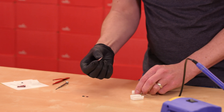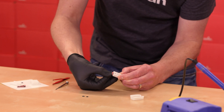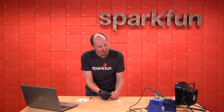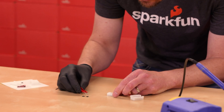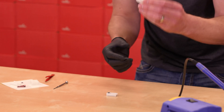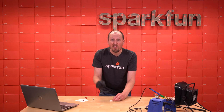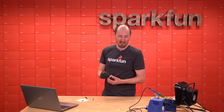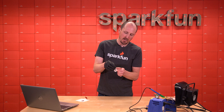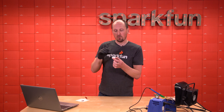For reassembly, take the PCB and slide it into the slot on the inner shell, line it up and it gets a little tension and then locks in with a small snap. Then put the glass back on top in its little chamber, then the O-ring right above that, then take the outer shell of the enclosure, line up the hole with the glass, come straight down — and that's the actual snap. So satisfying. As a mechanical engineer designing the enclosure, it's perfect. We've got a perfect amount of tension with the little nubbins on the side pushing into the outer shell, sandwiching the sensor, the glass, and the O-ring with just the right amount of tension to hold everything together.